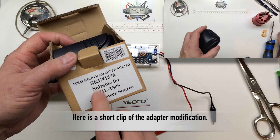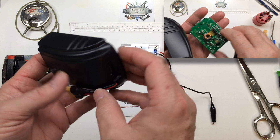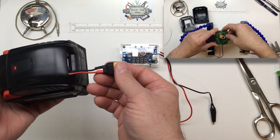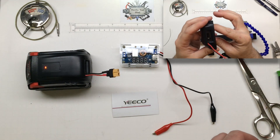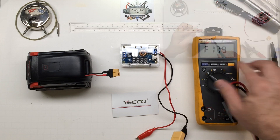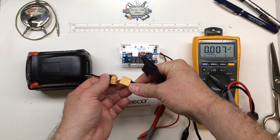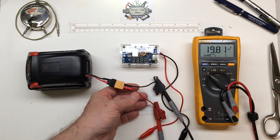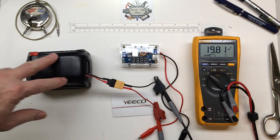In this case I'm going to use this M18 adapter — I actually did a video on this about a year ago about using these for a USB adapter. The boards have a really easy spot to solder onto, and we can make a really nice 18–20 volt output out of a pack very easily. I've got an XT60 mounted on here, and we bring over a meter and get right at 20 volts output, coming right off the terminals where we solder this on.